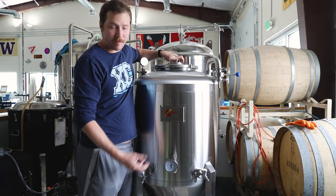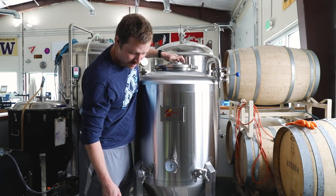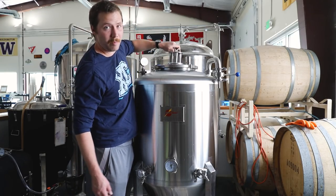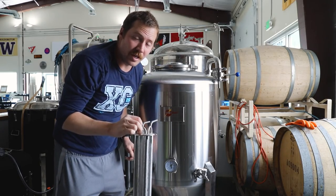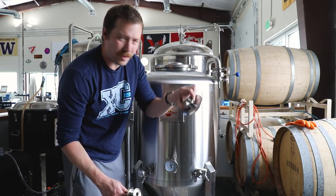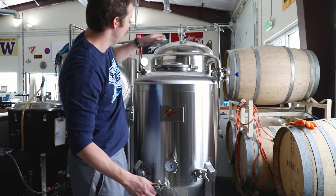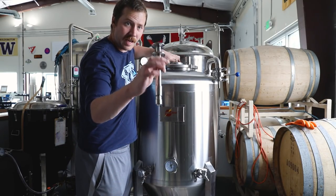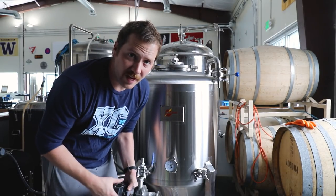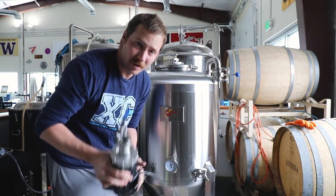Now this is filled enough with caustic — about a third full — so I can get some out of the sample ports to make sure those are clean on the inside. I've got to take the cooling rod back out so I can hand wash that while I put the CIP stuff in. We do the standard 3-inch to 1.5-inch lid on top, throw our CIP fitting right next to that, then grab the super-sized pump — for me, the Chugger Max. Had it for a few years, works like a beauty.